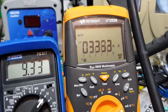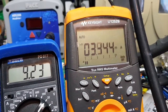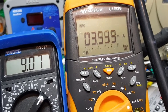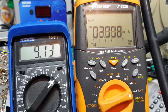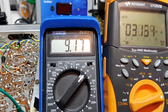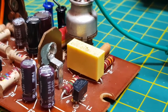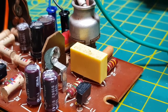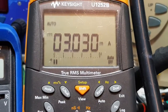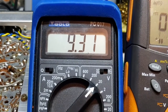To be fair, that ain't far off — 3.3. So I'm just going to adjust this one. Bound to be the wrong way. That's not moving. I've just remembered these are painted in. Well, they have moved it a little bit — 3. So you can see our midpoint voltage is 9.16. That needs to be 8.9. So again, we're not very far off. But you can see there's some green paint, so I'm going to have to put some acetone on that just to release it so I can set it up. You do find that this reading bounces all over the shop, but to be fair, if it stays like that, that's no problem at all. I can leave it exactly as it is. That one's a bit high, so I just need to bring the midpoint voltage down.